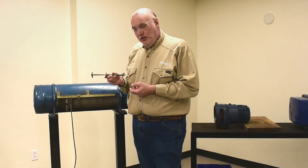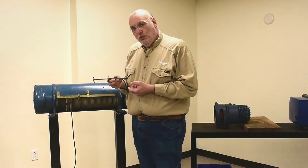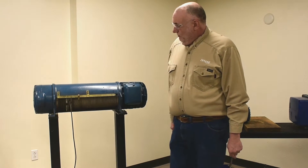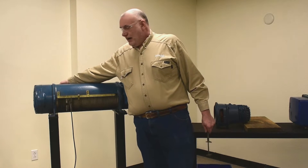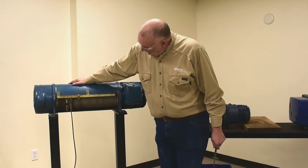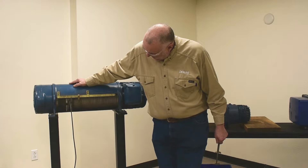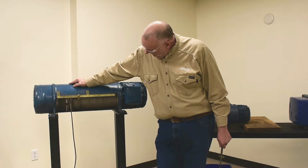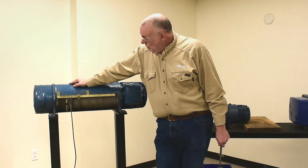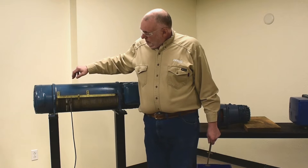You may recognize this as a key hoist rope guide tool — it's special and it really does help to do the job. One of the future videos will be on the removal of the rope guide. As you can see, there's limited access to it through the opening where the rope lead-off is. There's also a slit across the back that's only about an inch or so wide to help guide it around the drum when you remove it. It's relatively heavy, as it's made up of several segments of cast iron held together by a steel band, and it has to be fed in and handled very carefully to get it reinstalled. We get a lot of phone calls about that, so eventually we'll have a video for that.